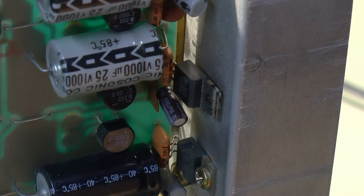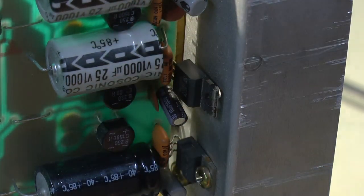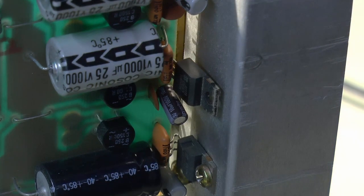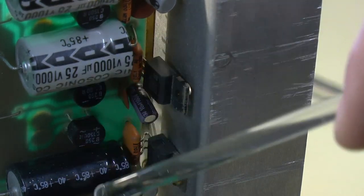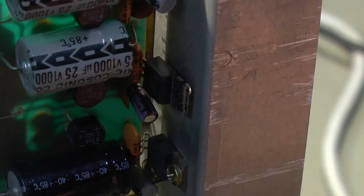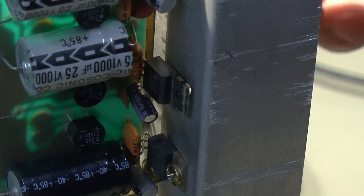Looking at it, this is just about the most bog-standard electrolytic ever — 40 volts, 10 microfarads, tiny. I'm going to whack anything equivalent in there to test it, but I'll also order replacement parts for all the other capacitors in this unit because they'll likely suffer a similar fate soon. The new part is in — soldering this thing in was horrible because there are wires right next to it which I may have slightly burned. I hope they're still fine — they're the output wires from the transformer. I thought about taking the whole board out, but the transformer output wires are soldered directly to the actual windings, so if they failed I'd have to unwind the transformer.